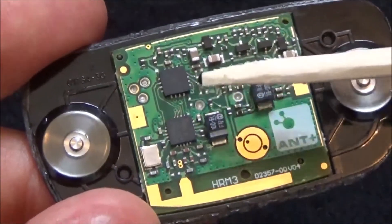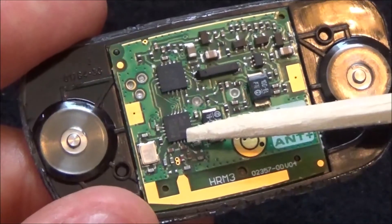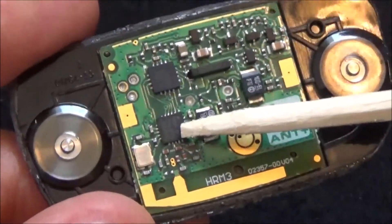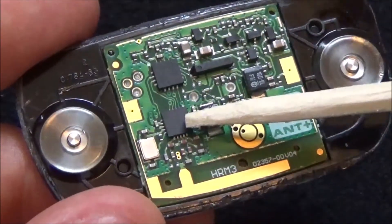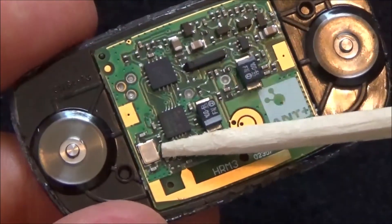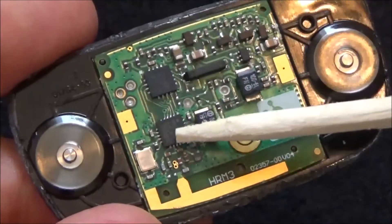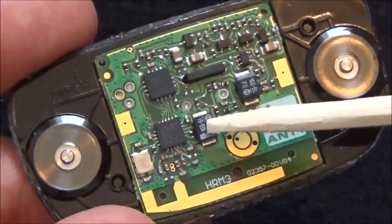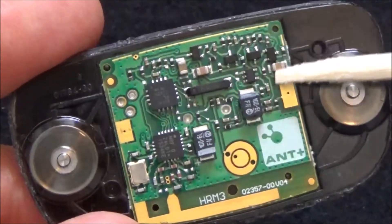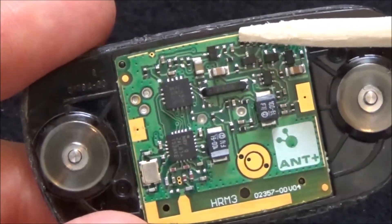The signal is then sent to this chip here, which is a nRF24L01+, a 2.4 gigahertz transceiver — a device that can both send and receive signals. This little silver thing here is the tiniest crystal oscillator I've ever seen; I believe it's a 16 megahertz clock chip that sets the speed of that transceiver chip. These little guys here are electrolytic capacitors, there are some other capacitors, and various tiny transistors. All these small components are tiny resistors, about a millimeter long.